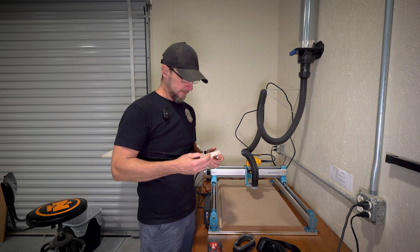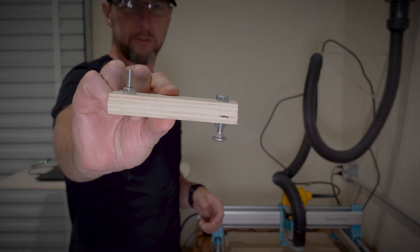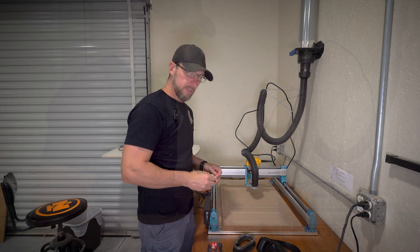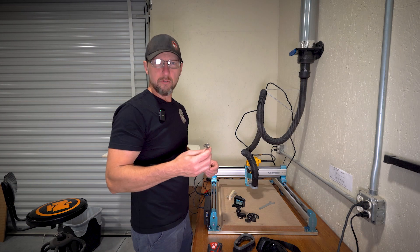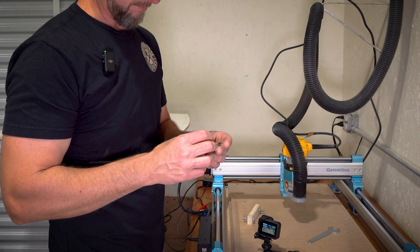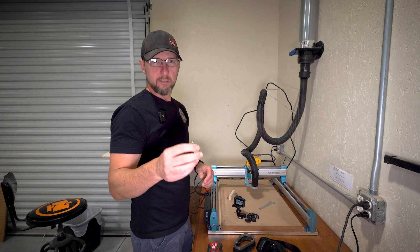I don't really have a fancy tramming tool. I've actually just taken a piece of plywood, put two quarter-inch carriage bolts in with some nuts — this end is going to go in my collet and I'll show you how that works. What I've been using to flatten is just this — it's a bin stack one-inch three-wing cutter, just for flattening boards out. I'll leave a link down in the description, you can pick one up from Amazon if you need it.